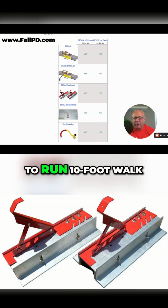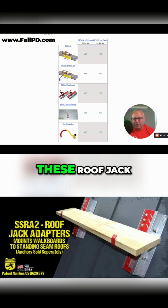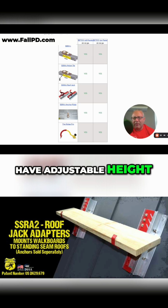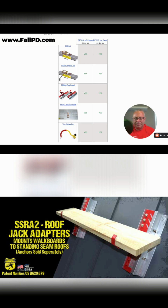So if you need to run 10-foot walkboards, you can remove the D-ring of the SSRA1, mount an SSRA2 Roof Jack Adapter on top, and you can run 10-foot walkboards. These roof jack adapters have adjustable height feet on the side for different height seams, and then the red roof jack adjusts for different roof pitch.